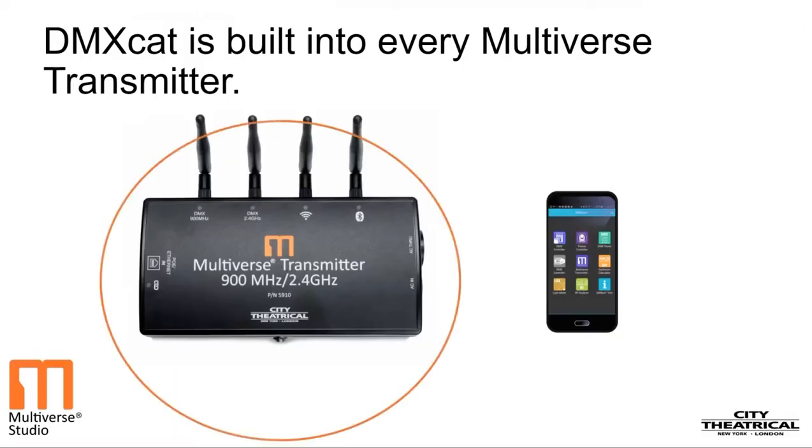You may also have noticed there's no actual user interface built into Multiverse Transmitter. There are no buttons or screen on it for making settings. Instead, we build a DMXcat into every transmitter. You only need to download the free app from the Play Store or App Store and you're ready to go. This allows remote setting of Multiverse functions from your phone, as well as a more detailed user interface than is possible when the screen is on the unit itself.